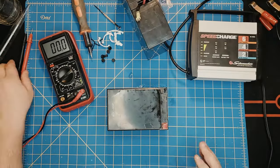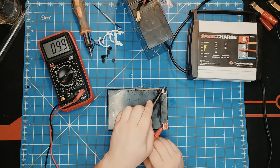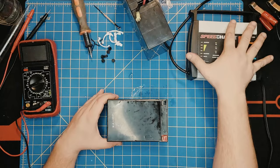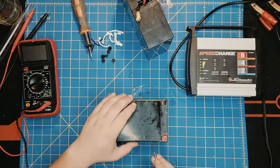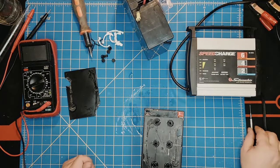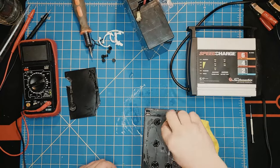At this point, I'm happy with where the battery went so far as we test the voltage. It's at around 9.9 up to 10 volts. We put this on the side before we engage the real charger, which will bring it up to real life. We cannot forget to check for water again. Visually it doesn't look bad. Down the line I might have to add more, but for now I will just go ahead and start charging it after I drain all this water.